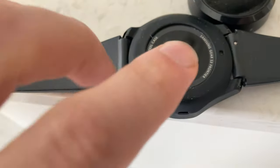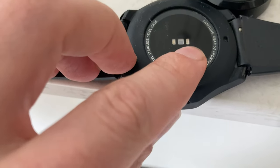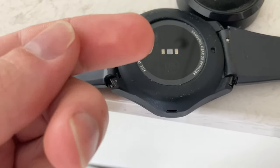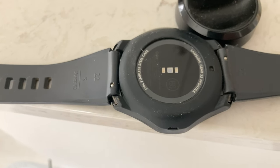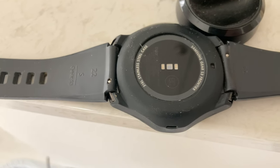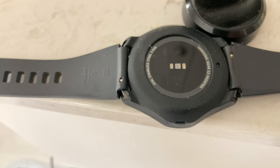Okay, that's a heart rate sensor. It uses those two LEDs to the side and side, and that camera sensor in there to shine light into the skin of the wrist of the wearer. And then the camera takes pictures of the skin, and through optical interferometry, it can determine blood oxygen saturation and the pulse rate.